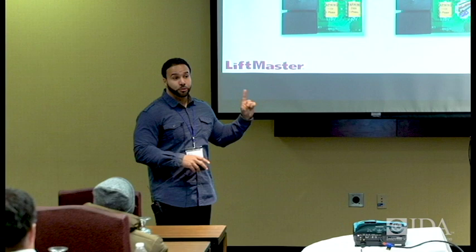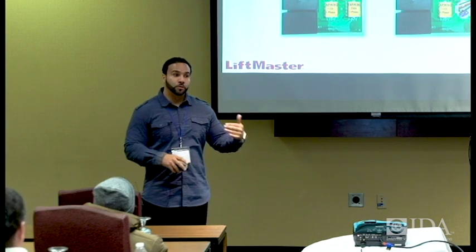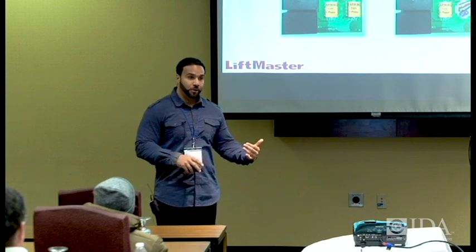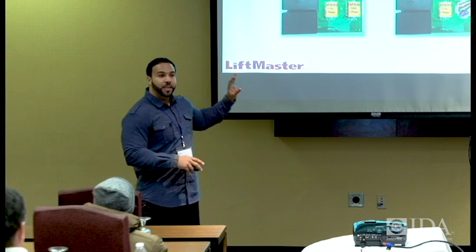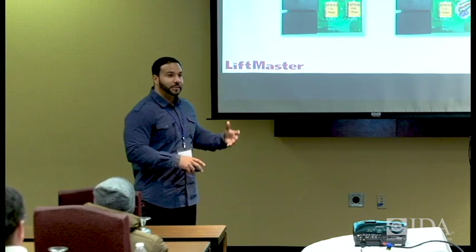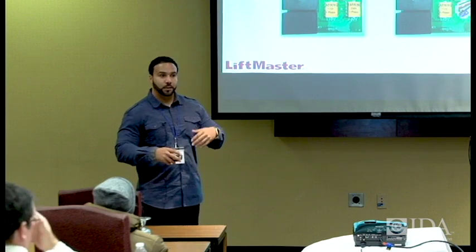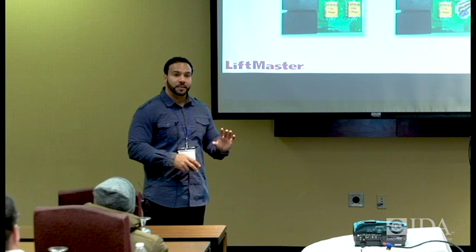However, if you want to use 208, we recommend you get a buck boost transformer. A buck boost transformer will give you an extra 15 to 18% on your incoming voltage, and it will actually take you up where you need to go, to where now the operator itself is getting 215, 220, 230, and it functions properly, okay? Just something to know about single phase.